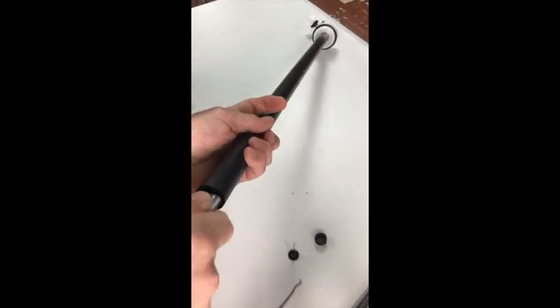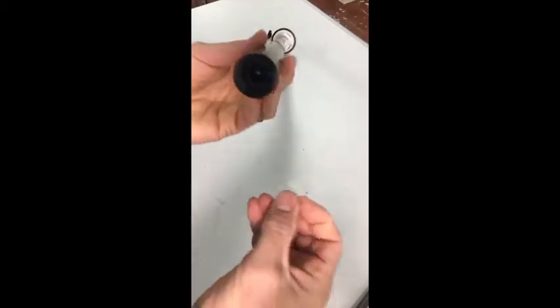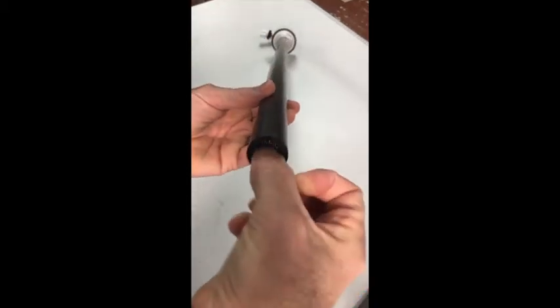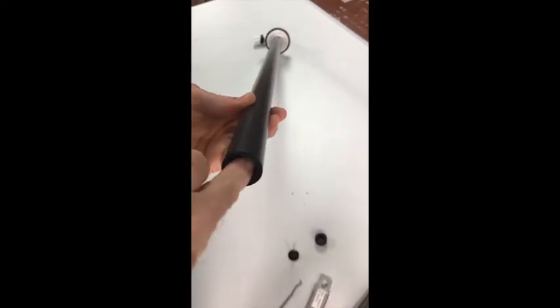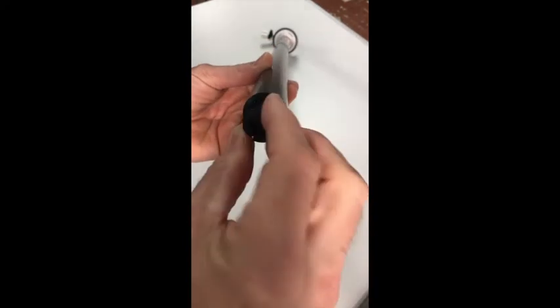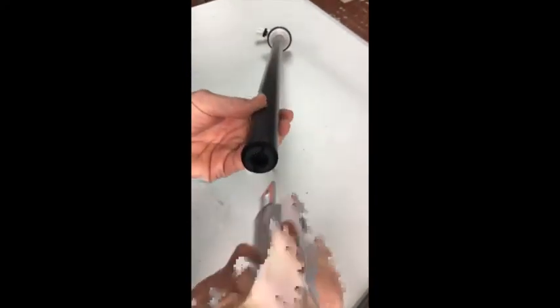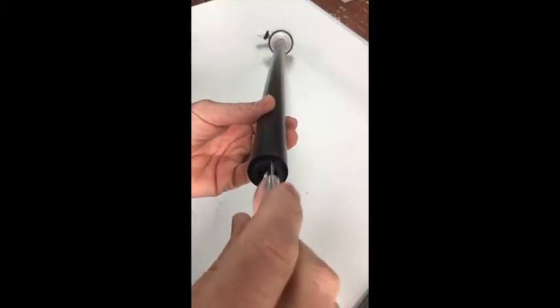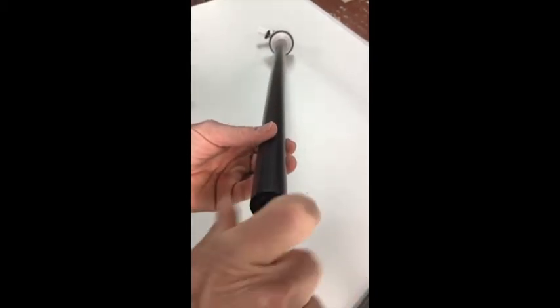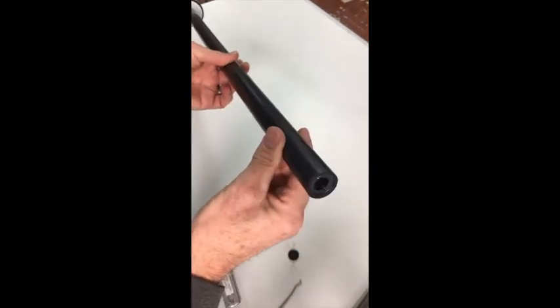And you'll know when you get to the end. And now we just put back in the same screen that we took out. And now finally the top slotted nipple. And as I said, you could use just a common nickel, but I've got this mending brace, so I'll use that. And there it is. It's all together. And now we've got a check valve that won't let the liquid backflow. There you go.